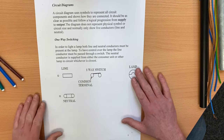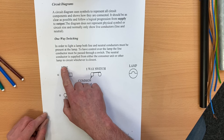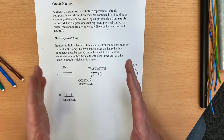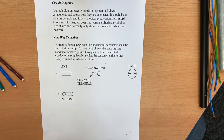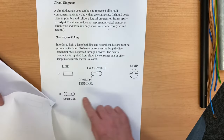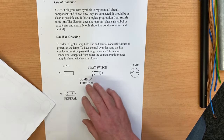These circuit diagrams give an overview of what we're going to be doing with our conductors and can help you wire the circuit. I've shown line and neutral but haven't shown the CPC connection, because the CPC takes the shortest and most logical route through the system. For example, if the CPC came out and went to the light first before dropping down to the switch, that wouldn't match the drawing logically, so I'll leave CPCs off and concentrate on the live conductors.